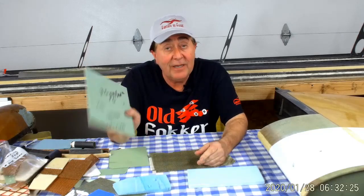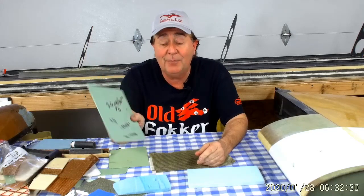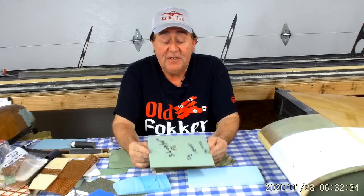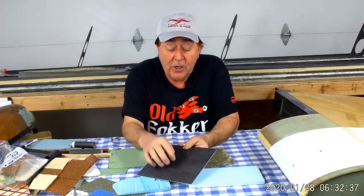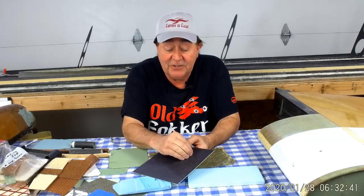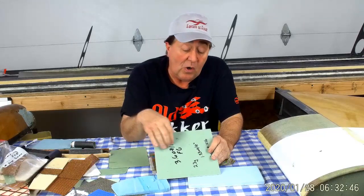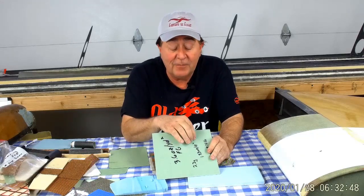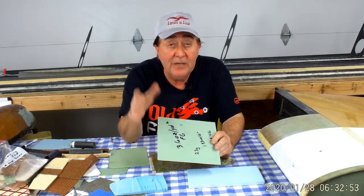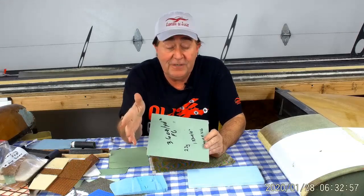You can't use sandwich panel for the whole wing and hit a hundred pounds — it's not going to happen. You could actually hit the numbers: carbon fiber is plenty strong enough, you don't need 5.6 oz — you can work with 4 oz and 2 oz, and put like 1 oz or 1.5 oz fiberglass on the outside. You could have the entire aircraft be a composite skin with a 15-meter span.